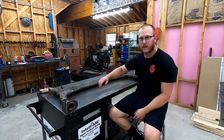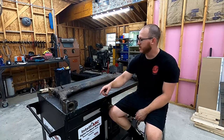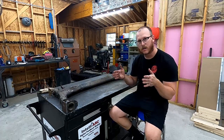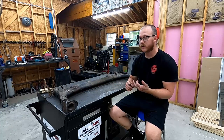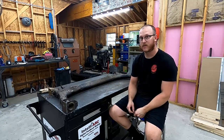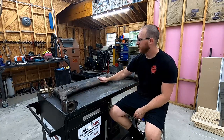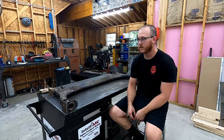Recap. So we got David's Mark II GTI rear beam all finished up. We took right at an inch out of each side, so we are narrowed an inch on each side, so we can get bigger wheels with less camber and maintain those big badass lips that we like. So he'll get this thing picked up soon. Hopefully we'll see it on the car with the wheels and everything fitting a little bit better.